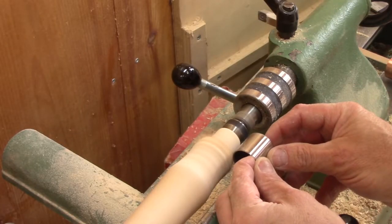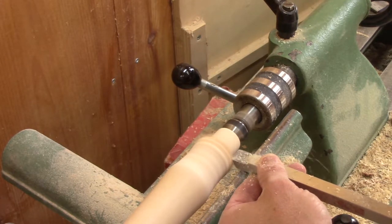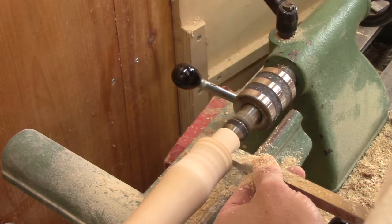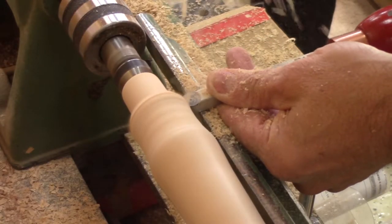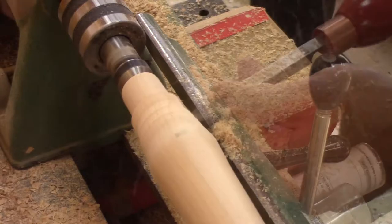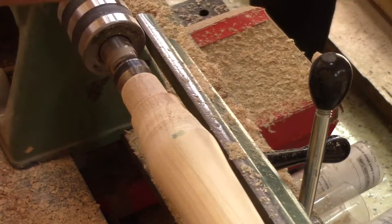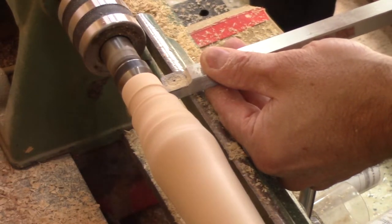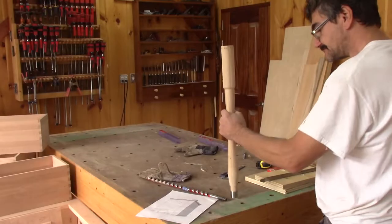But it's not totally finished. I didn't have the ferrule — Pierre did — when I started turning this. So now with the ferrule, I can finish the tip of the handle. When I'm close to the size I want, I remove a bit of wood near the ferrule and check if I'm at the right size. When it's perfect, I pound the ferrule onto the handle.